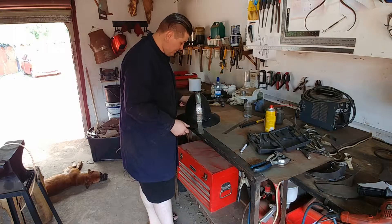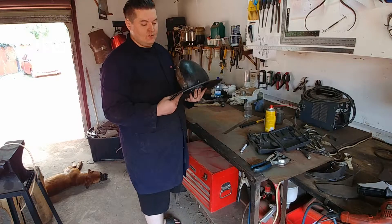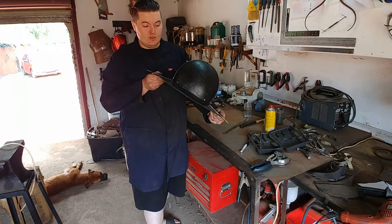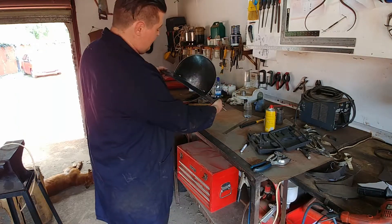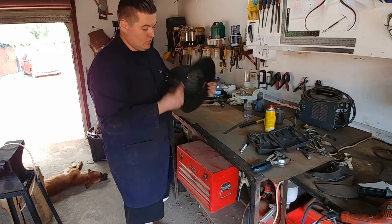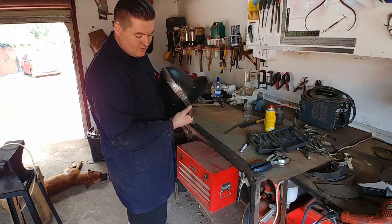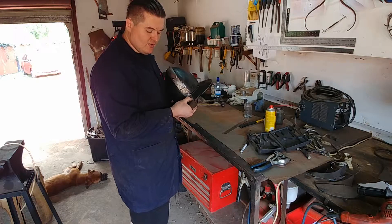After a bit of tinkering and fiddling, I've got the central lay fitted — the head's fitted all the way around nicely. The gap should be refined a little bit more so it fits in more nicely. Now what I'm going to do is roll the central lay just over the edge just a slight bit, and then I'm going to rivet it up near the end.